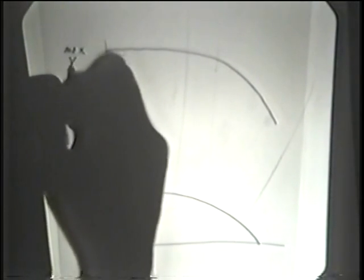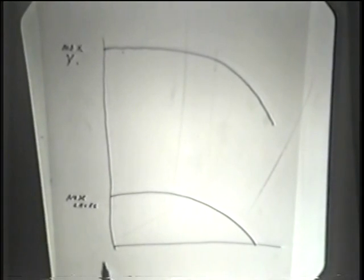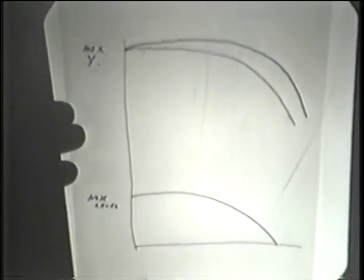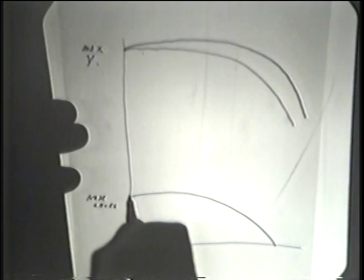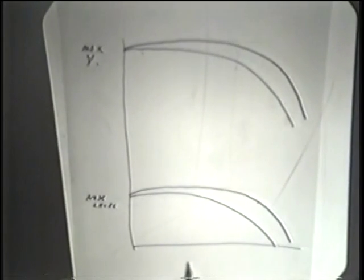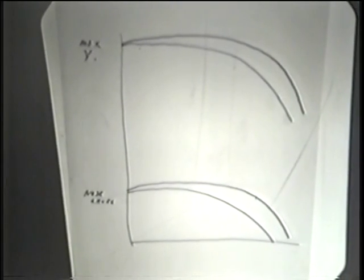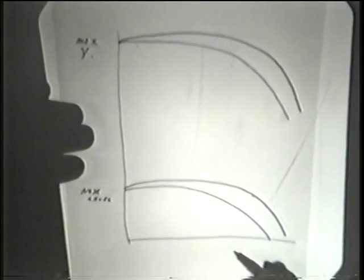And let's say this is your video information from noise floor or noise level to the maximum of your video information. In our normal machines, what happened was that they boosted the high frequency end of the video information to give us better detail. But if you did that, at the same time you also boost the noise level, the noise floor. And they boosted that so that they could unboost it later and have sort of a Dolby effect. So that when they de-emphasize that, they also push the noise level down as well.